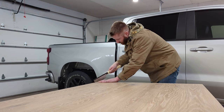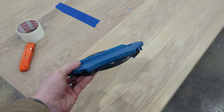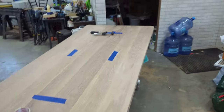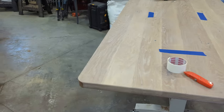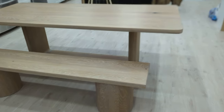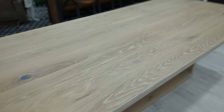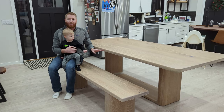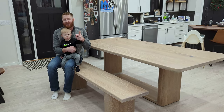Everything was complete at this point. I sent some photos over to my client and we decided the top should have rounded corners instead of square. I'm using this Rockler corner radius jig — the two-inch radius is the largest one I have — with double-sided tape to hold it on, then use the flush trim bit to curve all of these edges. You'll notice this is a sharp edge versus a round-over edge, so I have a little bit of contouring work to do. Check out these beauty shots — it was so worth the extra effort to cut those corners and curve everything. I think it just matches the base so much better versus having squared-off edges on the table top. Thanks a ton for watching, guys. I'm super proud of how this white oak table turned out — let me know in the comments what you think, and I'd greatly appreciate you liking and subscribing to my channel. See you on the next film.